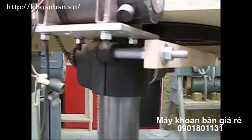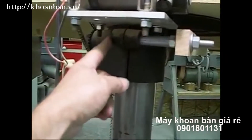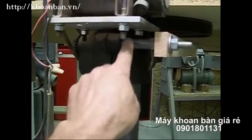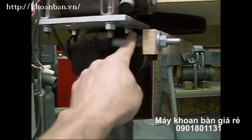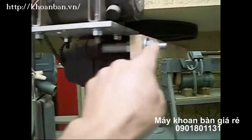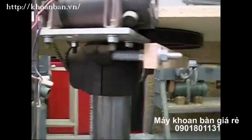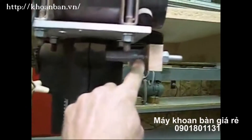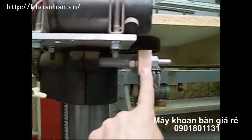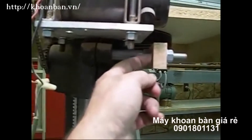So I thought of this. What it consists of is a piece of all-thread that goes through the collar — here's the threaded part over here. And then there's a piece of EMT electrical tubing; the ID of the EMT tubing is larger than the diameter of the all-thread. And then over here there are two nuts tightened together.